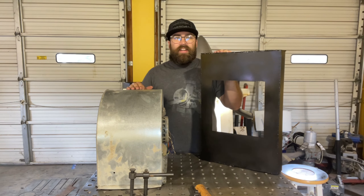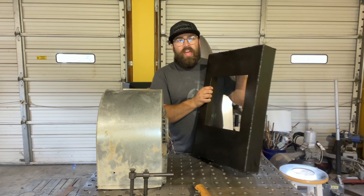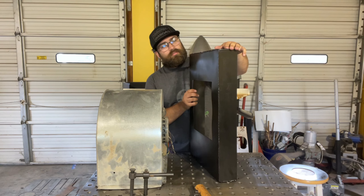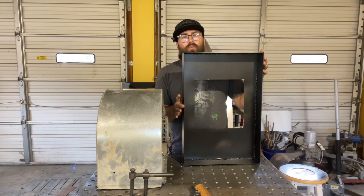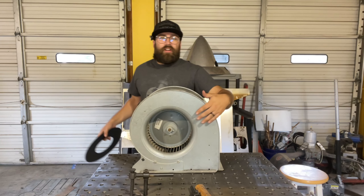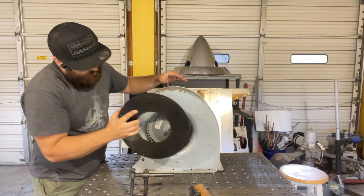In this case, I'm going to be sending all that smoke out the window. So what I do is I cut out a frame. This will sit against the wall. I will mount my fan on the inside, blowing the air out. The fan also comes with like a 9.5 inch hole. So I made a flange adapter on my plasma cutter.